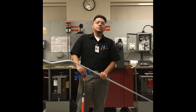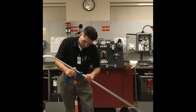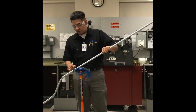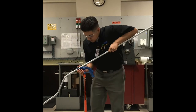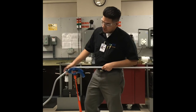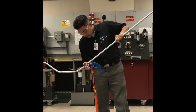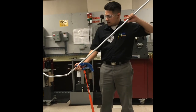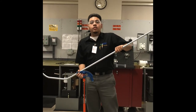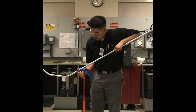For our third bend, it's going to be at 27 inches. Mark C, which is 27 inches. Make sure when you mark your C, you have to flip the bender inside facing the obstacle. And if we hit the line, we get 30 degrees. Fourth bend, which is D, it is marked at 35 inches.